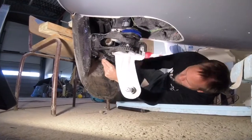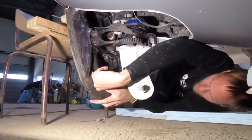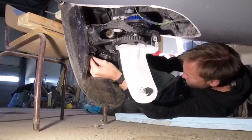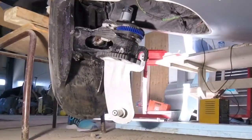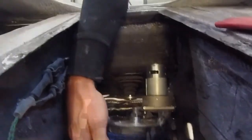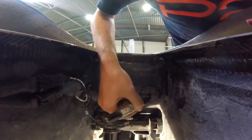It started out by looking at this conflict between the new gear drive motor and the forward bulkhead, which we knew was going to arise. To address it, we put it in the assembly to see precisely where that motor ends up when it's retracted. There was a conflict, but luckily it was not very pronounced — a small distance the motor had to go into the bulkhead, ending up on the side of the retraction mechanism. Quite close, but luckily completely solvable.